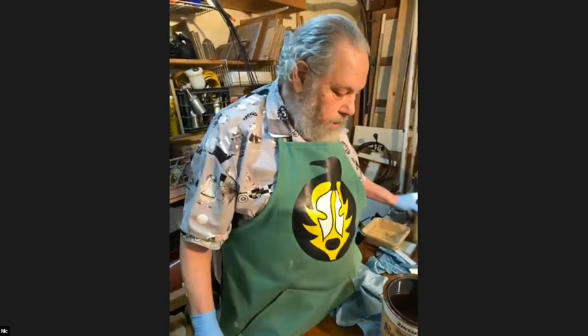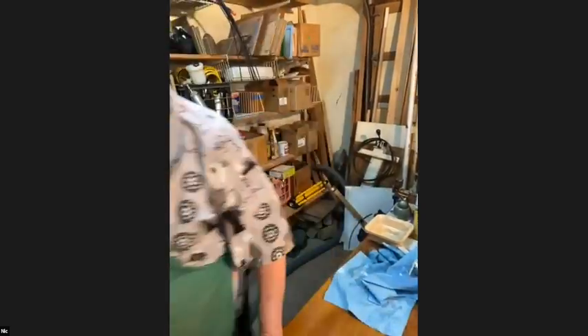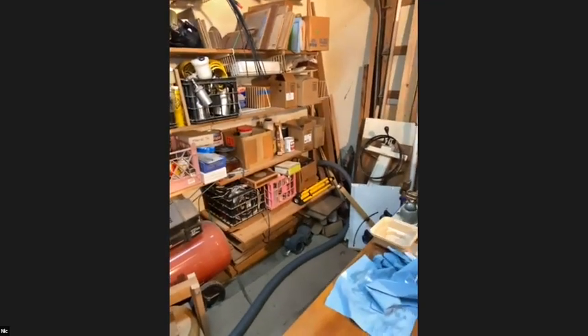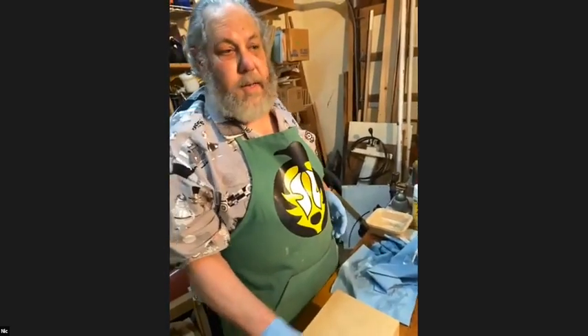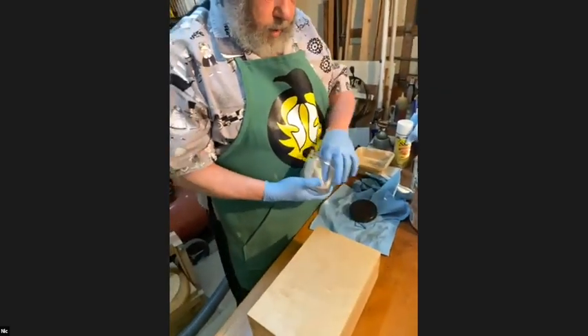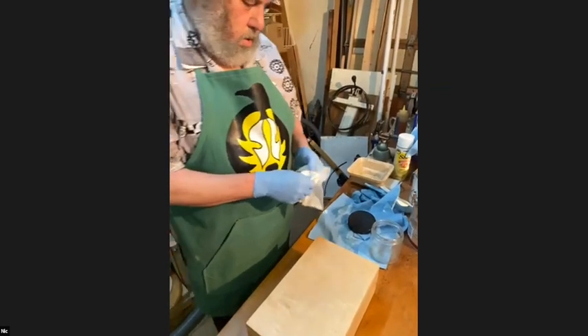Or you can resort to French polishing. To French polish, seal the wood as I showed you, let it dry — about 10 minutes — de-fur it, then make up a French polish pad. Has anyone done French polishing? Jeff had problems with streaking and unevenness. I take cotton and wrap it in linen to make a nice pad, then charge the pad with my French polish. Traditionally it's just shellac, but that causes three problems: if you don't move smoothly enough it sticks and leaves rag marks; too much causes curdling — little ridges; and the pad can put material on or take it off, creating streaks.